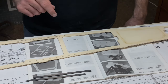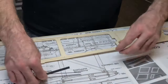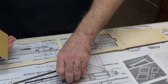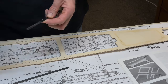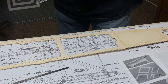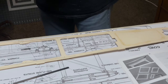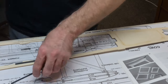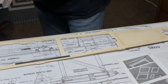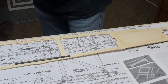So I'll get these drilled out. I'm going to clamp these first. We'll mix up some epoxy, roughen these up, and clamp those. Let's see. These are 80. I hate using carbon fiber because it's dirty. I'm just over here running some 80 grit on it in a crisscross pattern to give the epoxy something to grip onto.